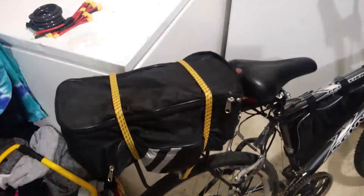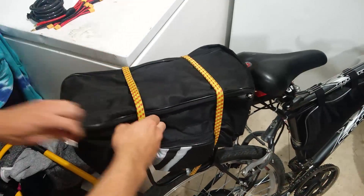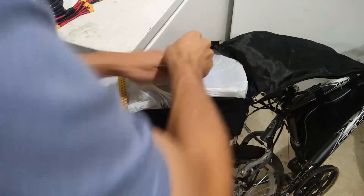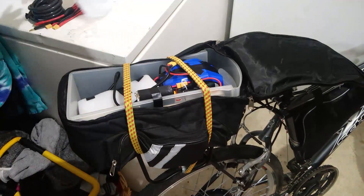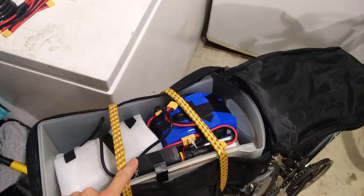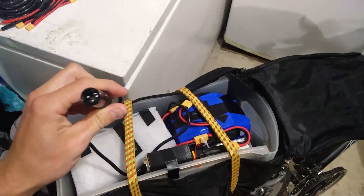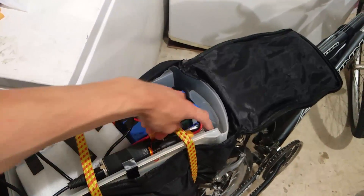So I'll go ahead and open this little pack right here. Inside of here, I've kind of tried to waterproof it as much as possible — I got a little plastic bag over a lot of the circuitry. You will see a couple of different things: first off, you will see the charging port. I 3D printed this guy. It uses a standard audio jack type style, the locking kind, and this will just click directly into here, and that's connected through an XT60 cable, which wires directly to the system.